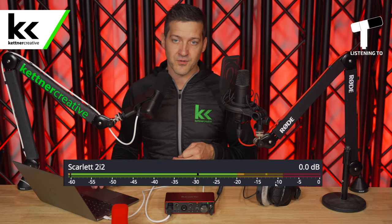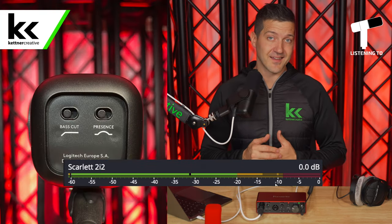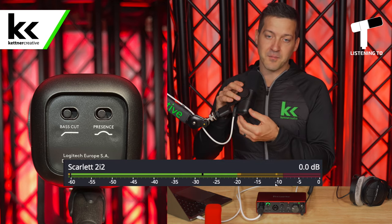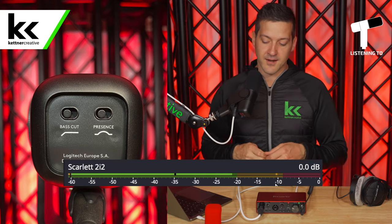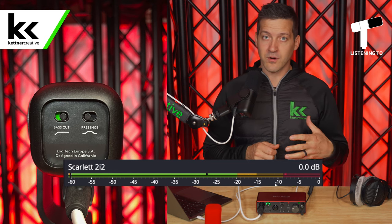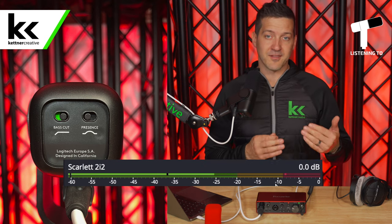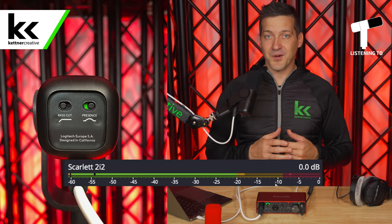For the first time in this video, you are listening to the Blue Sona now. Now that we have the gain set up, let's take a look at all the different ways we can make this microphone sound. On the back of the microphone there is a magnetic plate that you can remove. I turned the low-cut switch on, which will roll off the lower frequencies of this microphone — it's trying to remove your voice from the subwoofer of the listener. What do you think of this setting?